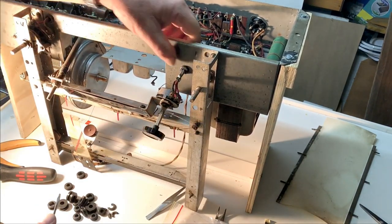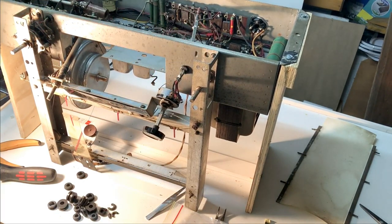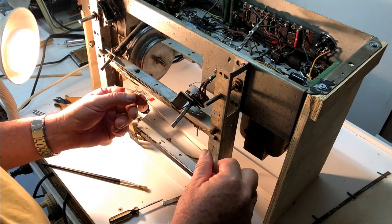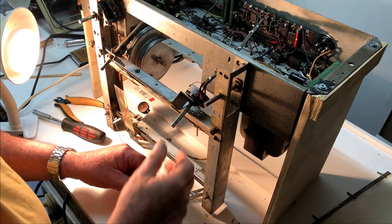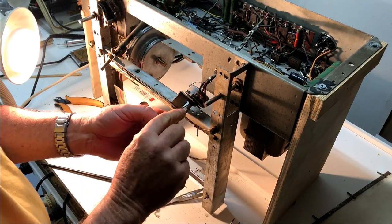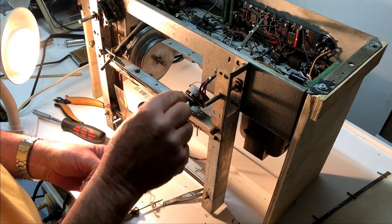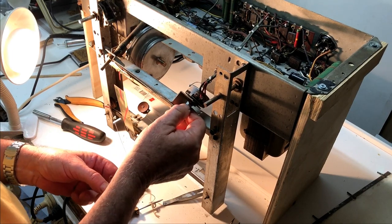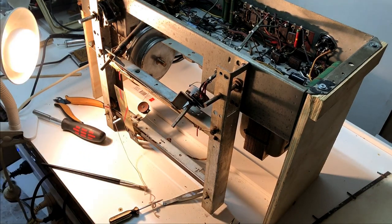There, that's sitting nicely. I don't think it's going to go anywhere. I've taken the string off the volume control that moves that pointer, and I think this pot must have been changed at some time because it doesn't have any way of anchoring the string to the spindle, whereas the others have a screw in the spindle. So that's not very satisfactory. Before I restring it, I'm going to try putting a hole in it with the Dremel